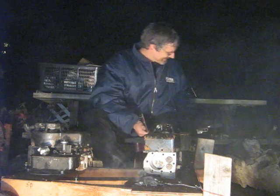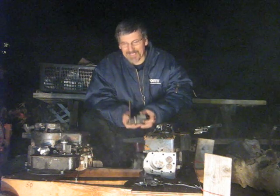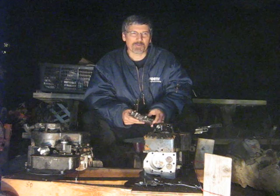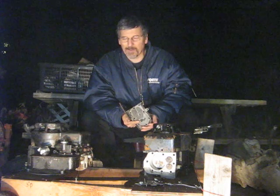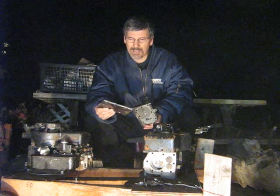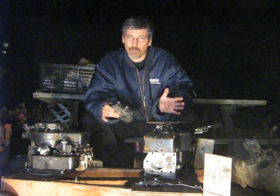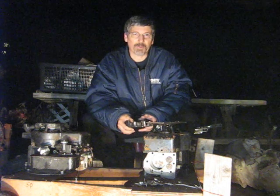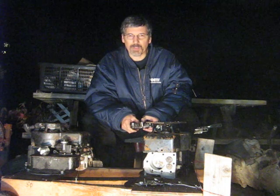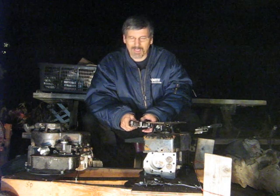Now that I got your attention — it didn't really put out 170 psi, especially with no cylinder head on it. Anyway, I just wanted to show you what can happen if you, say, made a head out of steel like this one — haven't got any valves in it yet — but if you have a really high compression ratio like 20-30 to 1, and you were to put a valve in backwards or something and deadhead it, you could have a serious problem. You could blow the head right off the engine.